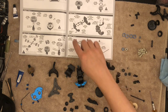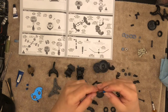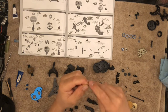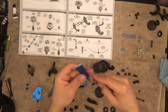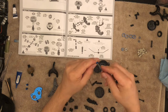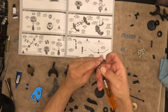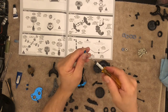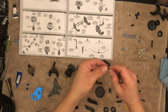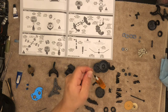We're finished with this step. Now for these little links — you're going to drive one in one side and one on the other, but I'm actually going to skip a step and just put them on the sway bar. I find it a lot easier to put these on the sway bar and then link everything up later. I don't quite understand why they do this step first, but I'm not going to follow it. Just make sure that this is flush and you're good.